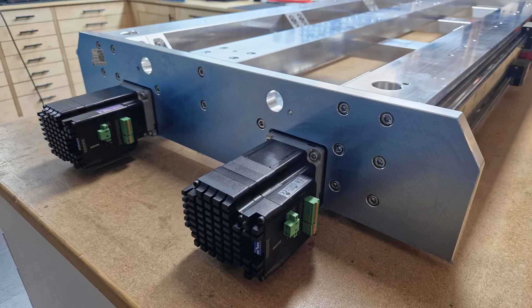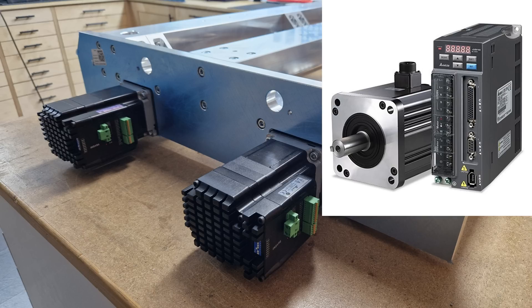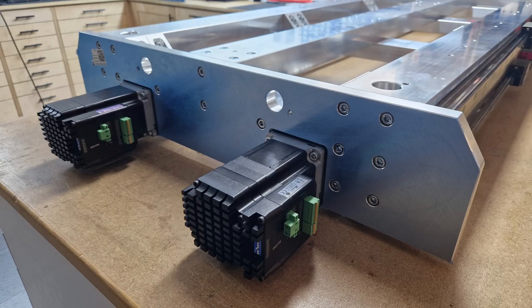When it comes to the tuning however they are a bit more challenging because they do not have an auto-tuning feature that more expensive servos have like the ones from Delta or others. Their tuning software can measure the load to inertia ratio of an axis and adjust the servo parameters accordingly, which usually gives already an acceptable tuning for most hobby machines. The IHSV servos do not have such a feature. What they call auto-tuning is in fact just a collection of different parameter sets depending on the chosen stiffness value. These parameter sets are identical regardless if it is a 100W or a 660W servo. So no real auto-tuning.